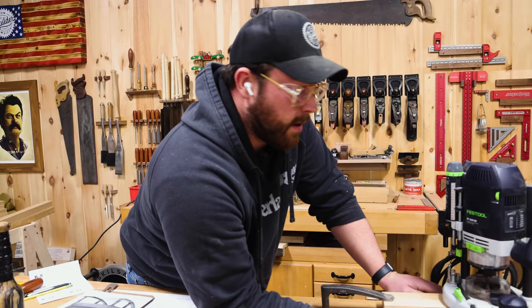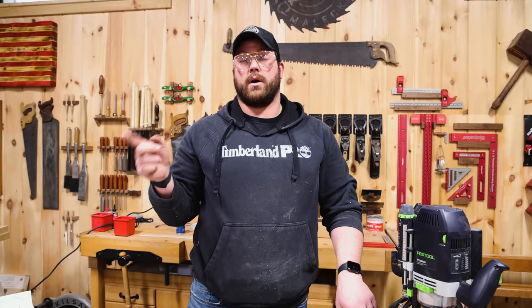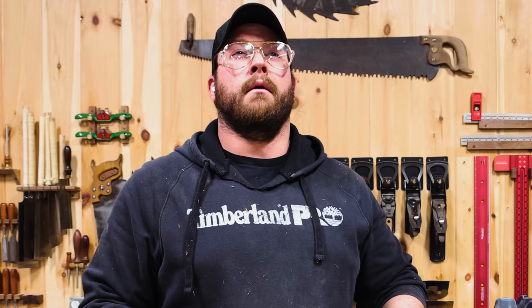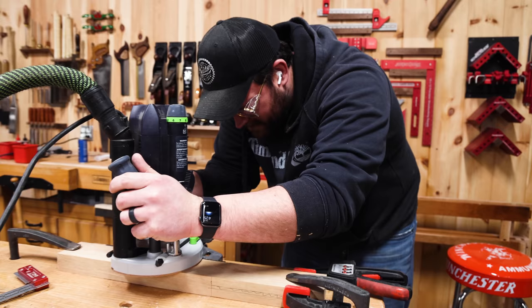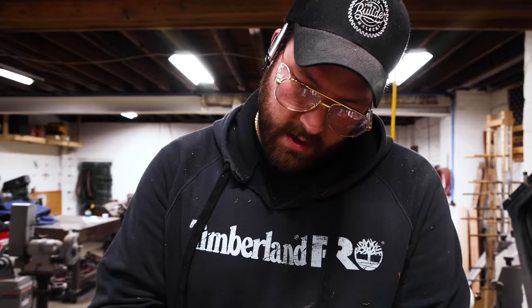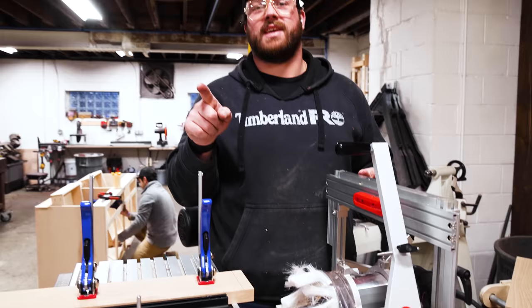Fun. I'm a little puckered because we only got one shot at this. We're going to cut our mortises with the edge guide on the router because I'd have to find center of every single mortise and there's so many locations. I think this will just be better and then we'll cut the tenons on the Panta router. All right, kids, this is what we call the moment of truth. No coming back. We did six tests, they worked.